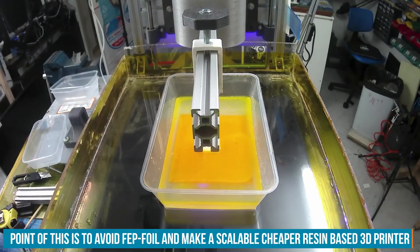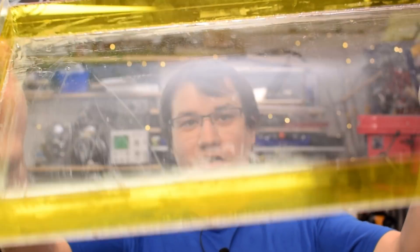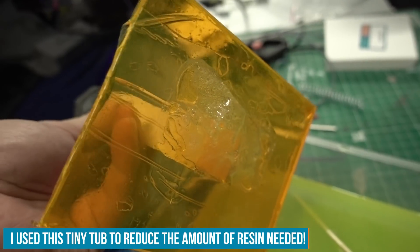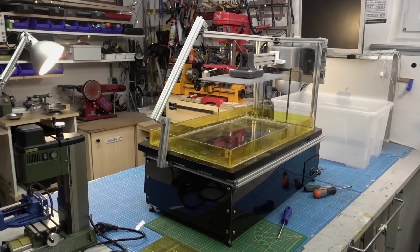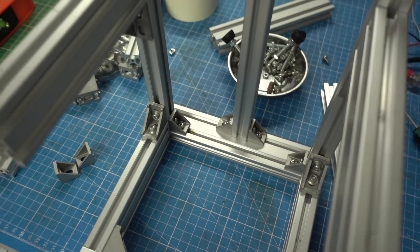In this video we're building a second iteration of that machine, but I'm taking that concept and putting it upside down. This is the vat of my giant 3D printer — a huge build volume. But I also understood that having such a big surface, it's very difficult to get smooth coverage and even light. Everything gets more complicated the bigger the surface gets. To avoid these complications, I scale the build volume not in X and Y, but in Z. So I take whatever screen I could get that is suitable for my application, but then make a very long Z-axis that you could extend indefinitely if you want to print very tall objects.